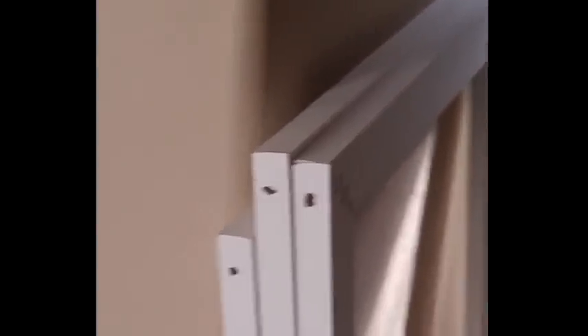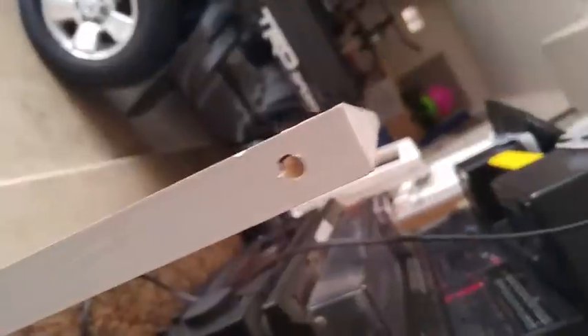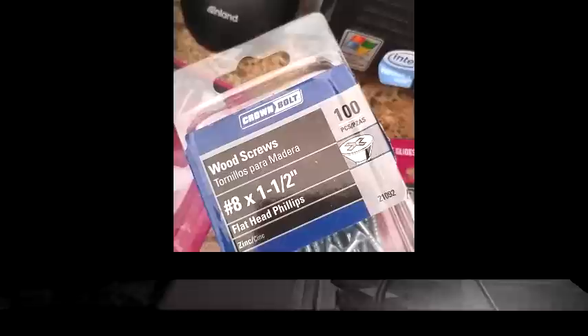The frames are complete. I made two — the front frames are going to be a little bit larger. I'm going to put a one and a half inch screw in there, and they are flathead countersunk screws, so I'm going to drill a little bit bigger. I put a 3/8 bit in there first, and then I go with a smaller bit — looks like a 7-64 — to get the hole started. The 7-64 inside of a 3/8. Those are number eight by one and a half.